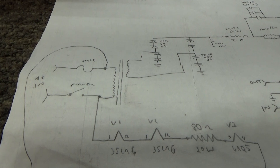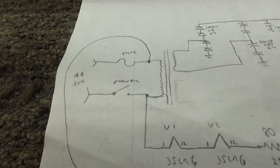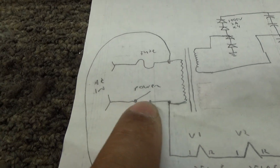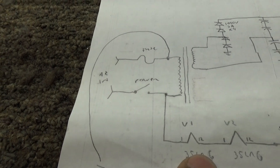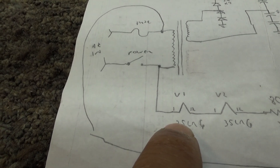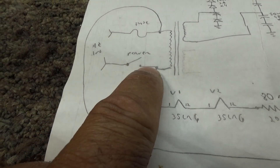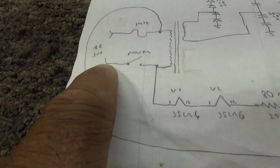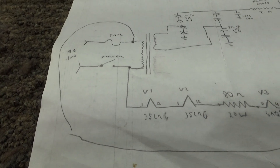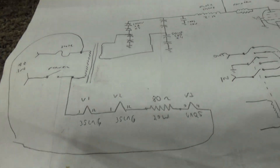They've got the power switch on one leg of the AC and a fuse on the other, and it's not polarized. What happens if the power switch is on and this tube decides to have a filament short to ground? You're going to have a very hot, live chassis — dangerous as heck — because this line is not fused at all. If that shorts to ground, you're basically shorting your AC to ground with no fuse. Very dangerous stuff — that can and does happen with amplifiers. That's why you always want everything to be isolated.